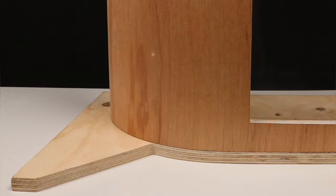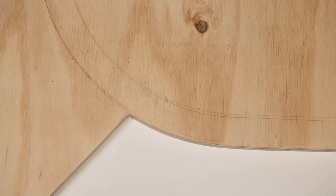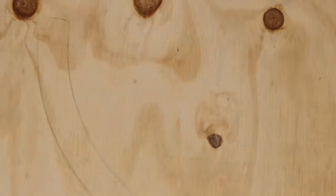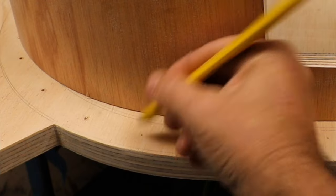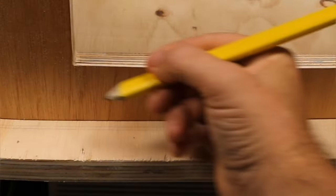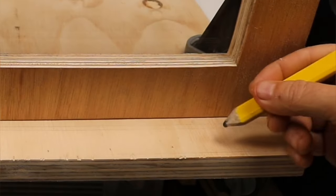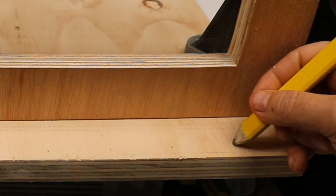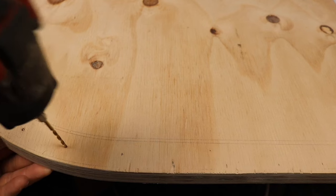That's why it's shaped like a shoe on the side, because that's actually the mouth of the port on the left. So I drew a little sketch of where the horn sits. That way I can drill the holes from the inside out, instead of going from the outside in. And I put them really close to the edge over here because I don't want to accidentally screw into the plexiglass, as you can see. They might not look perfect, but...